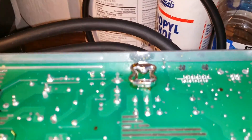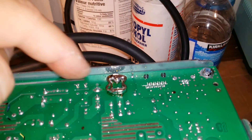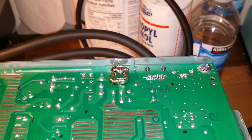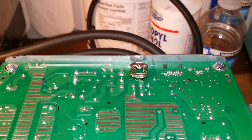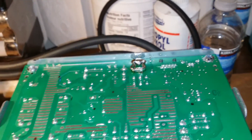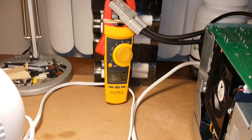Regarding the shunt: in the last video I had one shunt wire across the OEM shunt — now I have four in total. I tried with two extra shunt wires and I ran my fan and it went into overload. So with four, it should be enough to run 1500 watts constant, which should be about 70 amps on the current meter.